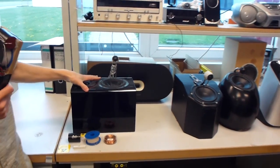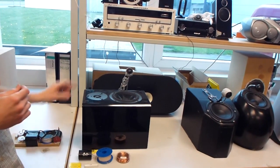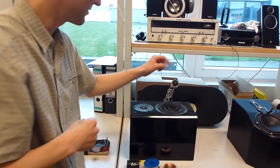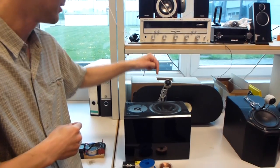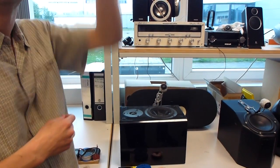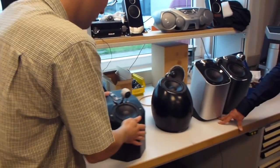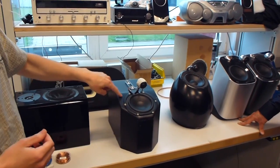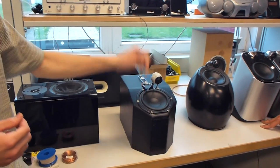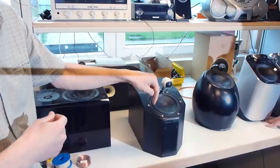So this was the first stage. The second stage: one of the issues we found is that it's very nice in this plane, and the tweeter is playing all around, but there is a heavy baffle here causing quite some reflections of sound from the tweeter to the woofer and then up to the ceiling and side walls. So this is an example of a later version where we tried to really cut straight around the woofer to see the effect and minimize all the reflections going downwards from the tweeter.